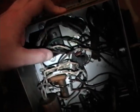There is some evidence that this was repaired. The filter cap on top here is disconnected, and there's a replacement crudely soldered in down there and wired in. Some crappy electrical tape and bad solder joints and bad splices. But I don't think this would take too long to get up and running, so how's about I clip this out, tack in a couple modern capacitors, and replace all the missing tubes. Let's try powering this guy up.